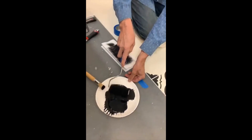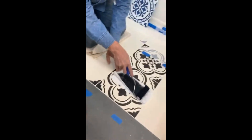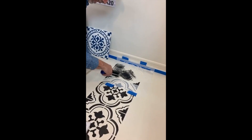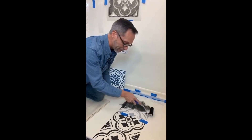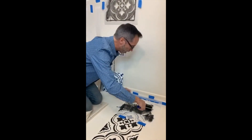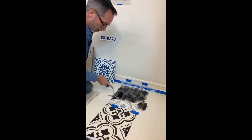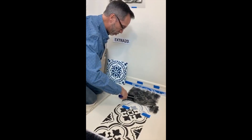Back to my roller — light load on the roller, quick offload. Back to my stencil. You see how easy it is to line this up. The registration that we've designed into our stencils makes this virtually foolproof. If you see it kinking up, just break it loose and use the roller to push it in. I'm going to build this up — trying to get nice even coverage, but not in one pass. Remember, this floor has been around a little bit, so it's got some distressing to it.